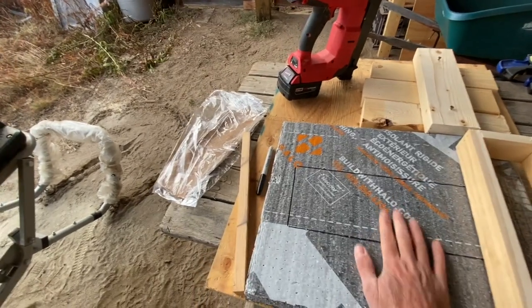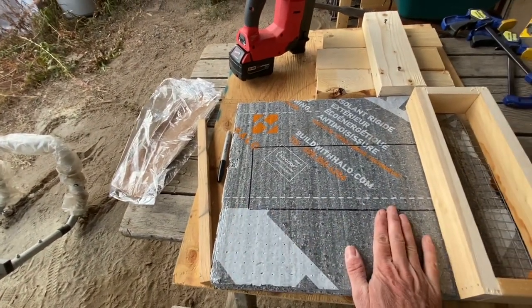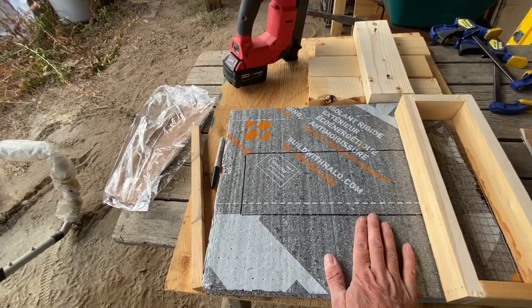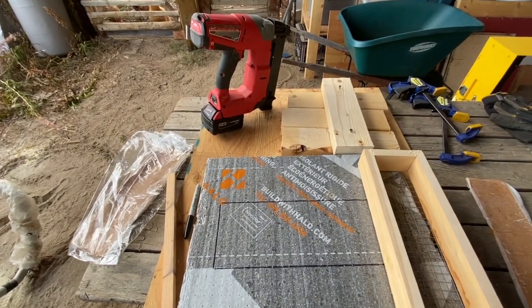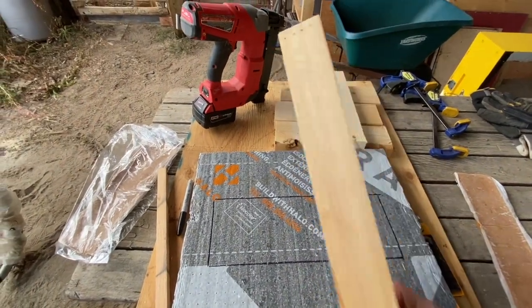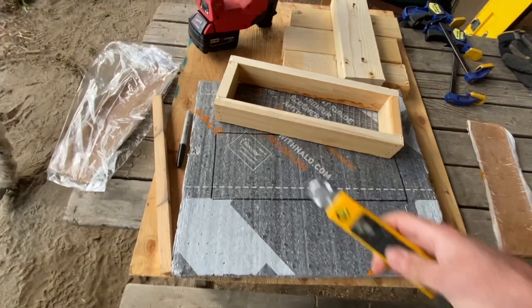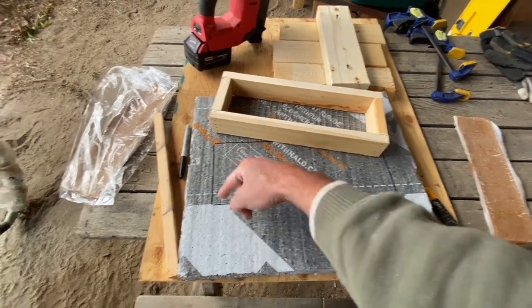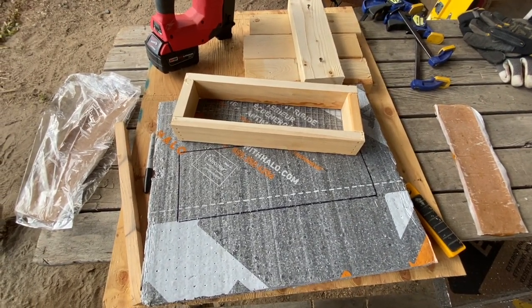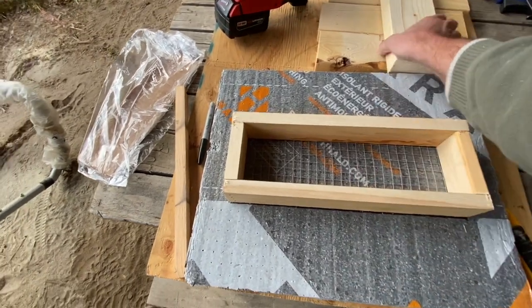I'll rip some shim bars that I'll place on top of the top bars in the top box, so this doesn't sit right on the box but sits about three-eighths to half an inch above. I'm either going to tape it with some type of tape so the bees can't chew through it, or I'll cut out a little piece of one-eighth or quarter-inch plywood. Basically this is just one-by-four with some brad nails in the end, a little hardware cloth stapled onto the back. I'll use my box knife to cut the styrofoam and compress-fit the frame in. I might use some construction glue or wood glue just to hold it together.